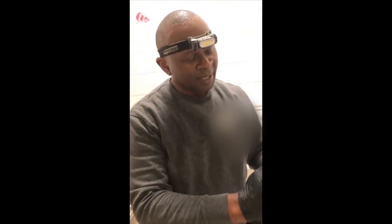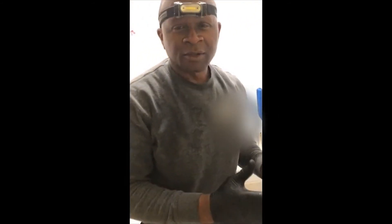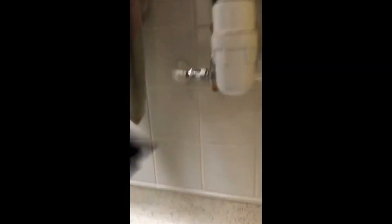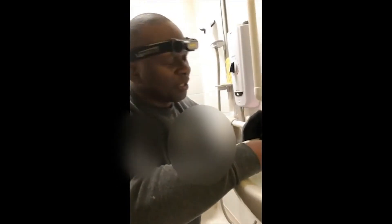There's no leaks, everything's okay. But the only problem we have now is the water temperature. We're going to try and balance the temperature of the water, so you have a balance — just in case you've got somebody who's disabled in the house or you've got children in the house, and you don't want them to burn themselves with hot water. So what you do is take a screwdriver or any kind of sharp object, put it through here, push it down, and that would come off. That's the cap. Here you have the valve. Now you can adjust the temperature. Put your hand to check the temperature of the water. Now that temperature is a bit hot, so we need to balance that.